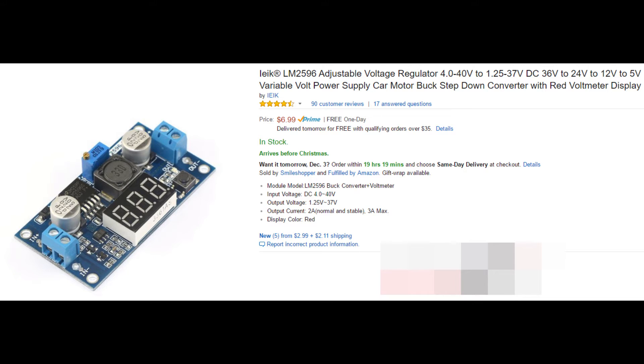Since the battery puts out 12 volts — which is needed for the field monitor — I'm going to bring the voltage down to somewhere around 7.4 to 8 volts to match what the normal battery provides to the camera. I don't want to put 12 volts into the camera. This voltage regulator, purchased from Amazon, is a variable adjustable type that accepts 4 to 40 volts input and outputs 1.25 to 37 volts.